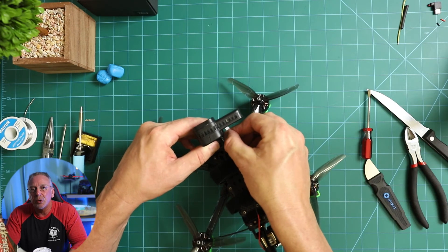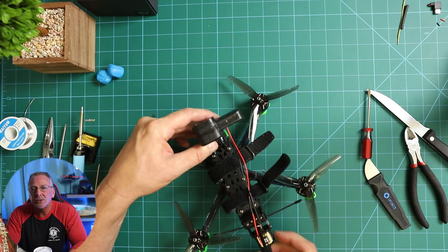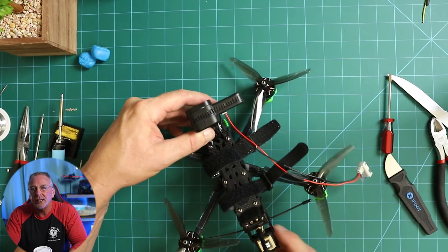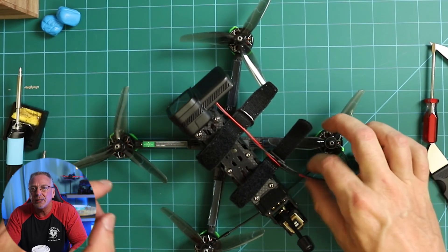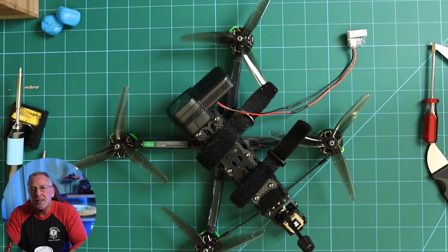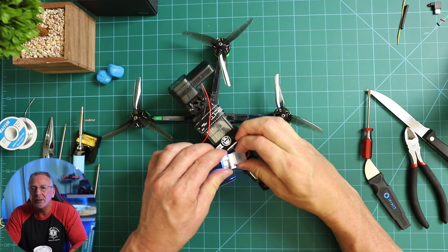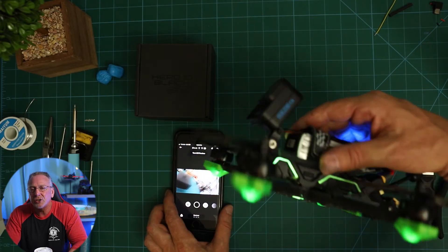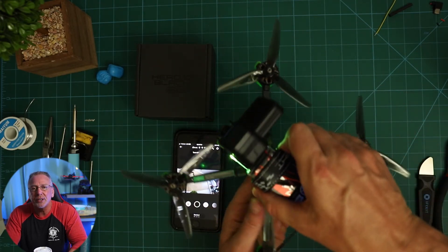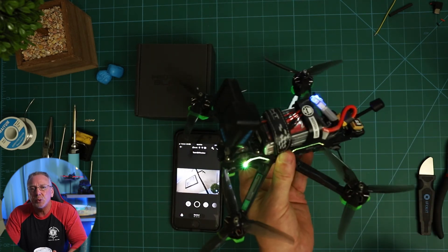And there you have it. Your cable is all ready to connect to your GoPro Bones and your FPV LiPo. Your connector only fits one way so don't force it — it goes red to the right. When you're ready to fly, just plug in the LiPo battery. Just connect your LiPo to the balance lead and it works with any 4S or 6S battery balance connector. I made myself a few of these connectors just so I had some spares — you never know when you're going to need them.